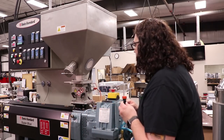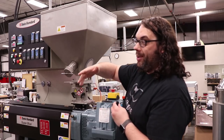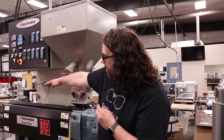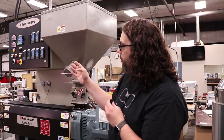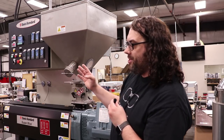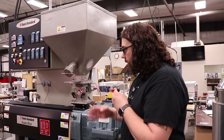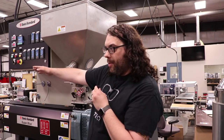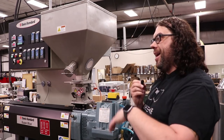So if I understood correctly, you — the mastermind — mix the color, it comes down through an auger, and inside there are multiple heat zones. It goes through each heat zone, then shoots through a proprietary process — through a die that makes it into a small strand, and then through a water bath of some sort. That part is proprietary and we're not going to show it here. Every manufacturer has their own way to do this and we don't want to give that away. That's how these guys get their quality.